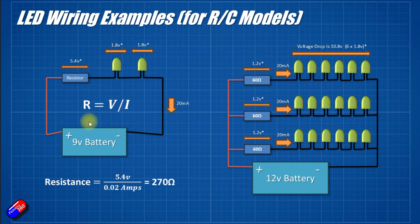So hopefully that answers it for both of you. To put two LEDs together in series, add a 270 ohm resistor. If you want multiples of six LEDs on a 12V supply, I would do it with individual strings each with a 60 ohm resistor. You could add a single resistor for all three strings and calculate it for all three, but I like doing it this way — it keeps everything neat, and it's easy to add more LEDs in another layer later.